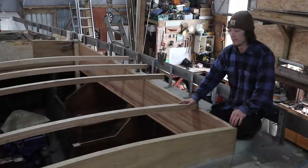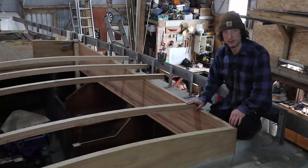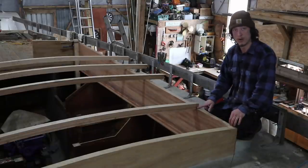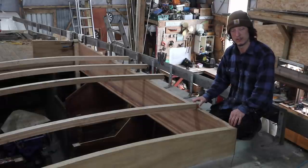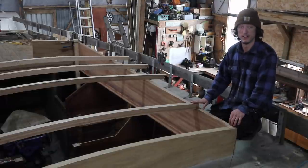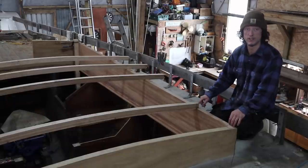All right, so I've now got the dovetails cut onto the first roof beam that I'm going to be installing. So the next job is to mark out onto the cabside timbers where I need to cut out the slot for this dovetail to sit nice and neatly down into the timber. So I'm just going to scribe it in using a Stanley blade.